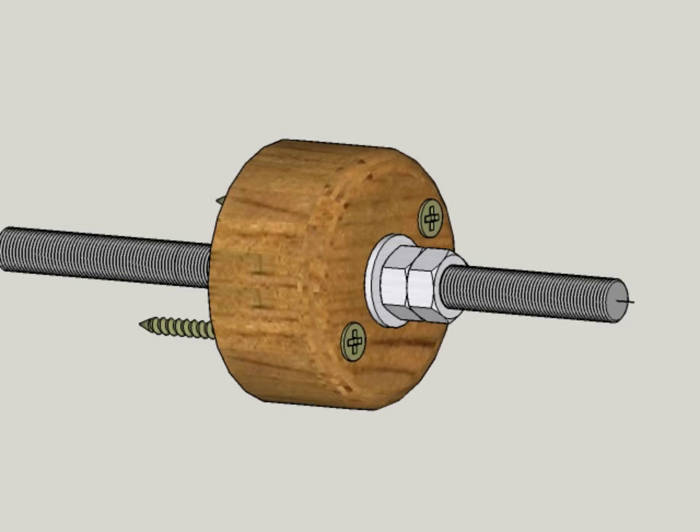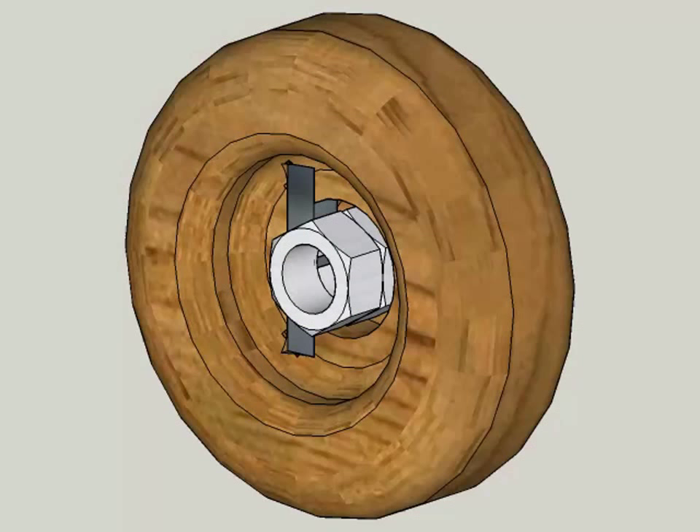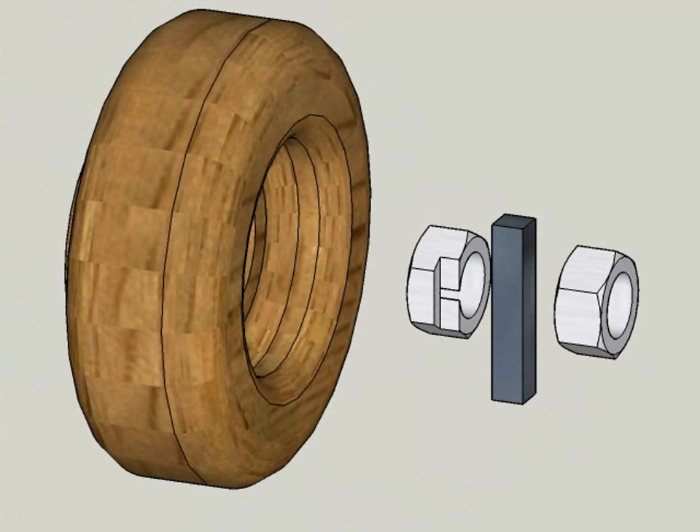But if you were going to turn it on the handy lathe, the easiest way is probably to drill the center hole and then press in a half inch dowel so you can hold that in the chuck — it gives you a nice handle. Line up all the holes and install the plug with a couple of gold screws, but don't use any glue because you need to be able to take this part apart for maintenance. The last step in the tailstock is to turn a nice knob for the end of the feed screw, or maybe you could do a crank handle of some sort.